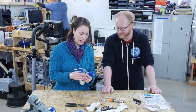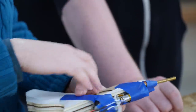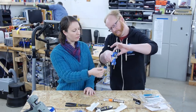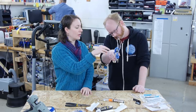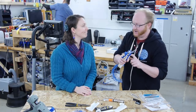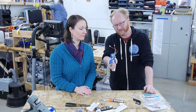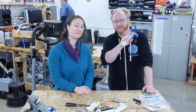If we have the motor on top, it gets it out of the way of the handle, we can move it farther forward, it doesn't get in the way of the trigger. It does add a little bit of a knob on the top. But if we can figure out a way - I also added this narrow nozzle here - so if we can figure out a way to add that to the smaller heating element, we can still have a long narrow end. I'll create some assemblies so we can flip the motor upside down, and then make it so we can rotate the motor centered on the axis of the gun, to get it as close as possible to the glue stick along with the bearing without going outside the main shape of the motor.